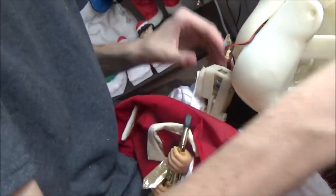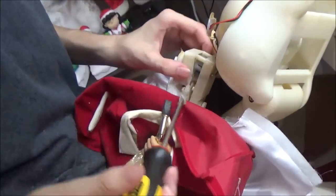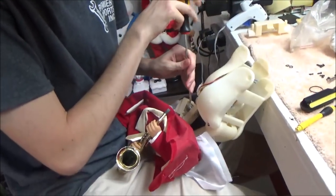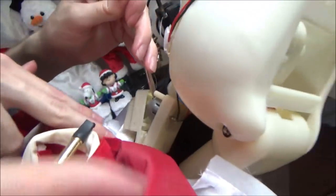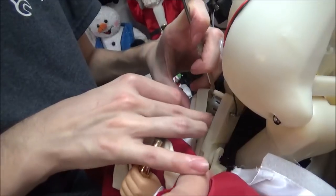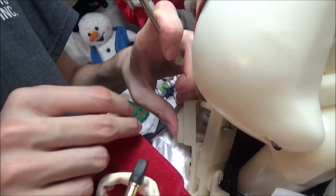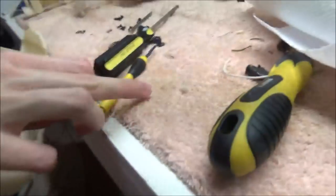When you take the levers off, it's hard to get them to stay on. You'll put them back on, but they don't always stay. Remember my black one at first? It kept coming off. It's not the best way because it puts a lot of stress. So if your mechanism's yellow, do not do this. Just take your time and go the long way. But since this mechanism is in fairly decent condition, I can do it. Oh, and you already got the bell piece out. Where's that split gear? You already got it out? I took it out, right there. Takes an 8-tooth? Yep, an 8-tooth.